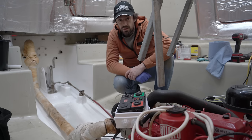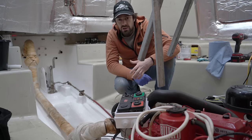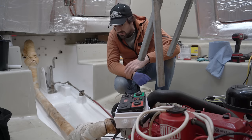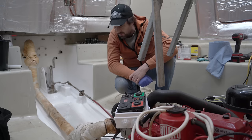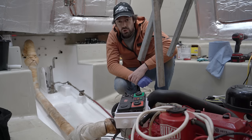That's more or less all the painting work in the bilge and engine area for now. It might seem slightly strange to do something cosmetic this early on, but actually it just means you can see if there are any leaks. It's much easier to work when you have light reflecting around the engine bay, so doing this quite early on is a reasonably prudent thing to do.